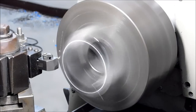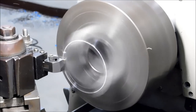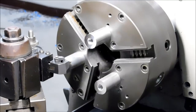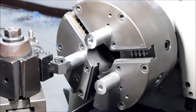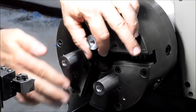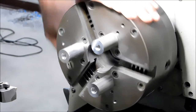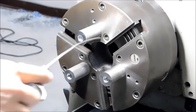Address the face of the standoffs to a common plane. It will be real easy to tell if you've got all of them, because you'll go from a saw-cut finish to a lathe finish. I think we're good. You don't even have to deburr, because all the burrs on these parts are going in the right direction — they are not going to be in your way. I'm going to bring it back around and put my jaws back in.